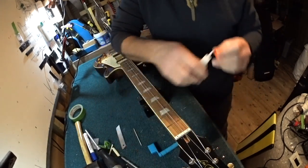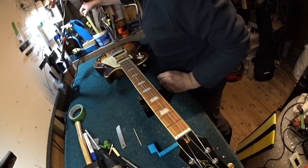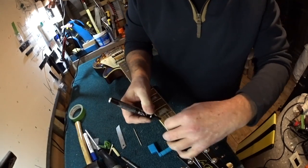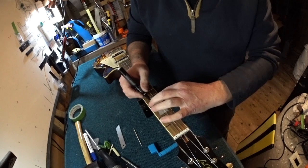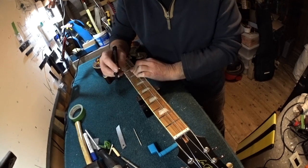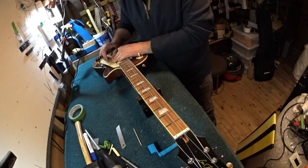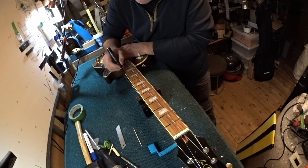Okay, so while that's pressing down on the copper, mostly along the whole length of it, I've got some fresh marker pens, courtesy of the random radiographer, a kind benefactor. So what I'm going to do is mark up the frets with these. Now it's a light fingerboard, so I'm using a sharp Sharpie. Is it called Sharpie, this one? It's a Pentel, but I'm using a sharp chisel tip, so I can get along the top here and be fairly confident it's not going to slip and go onto the fretboard, which is nice and light.